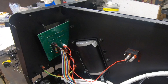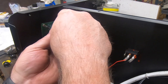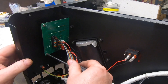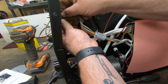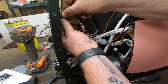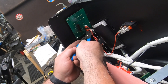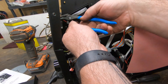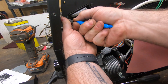This is where I realized that taking those four mounting screws out beforehand was the mistake. I remounted the board back into the front panel to give it stability for cable removal. For the big ribbon cable, I used both hands with patience, rocking it back and forth until the adhesive gave way. For the two smaller plugs, I used a small pair of channel locks to pull them past the sticky adhesive without ripping the wires out.